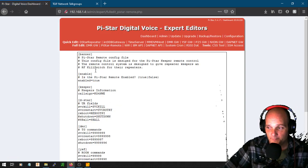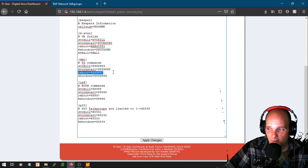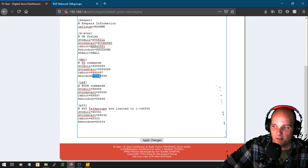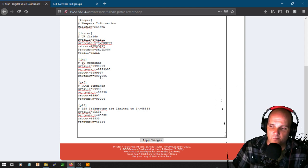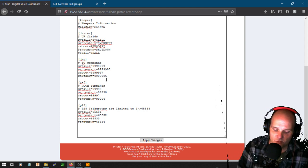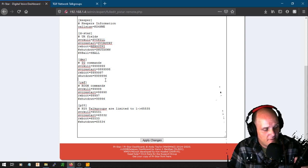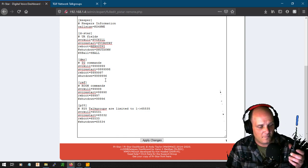Now if you look here beside it, DMR reboot and shut down, there's 6 nines and a 7. So 9999996 and 9999997. 9999996 is for shutdown, and 9999997 is for reboot. Now what that means is if you make a private call to 9999997, 6, it'll shut down, or 7, it'll reboot. Okay.